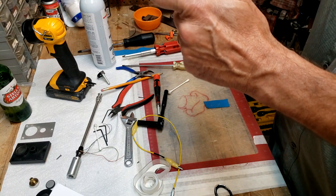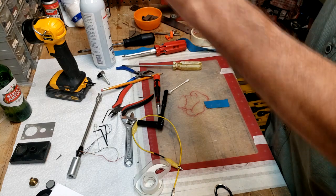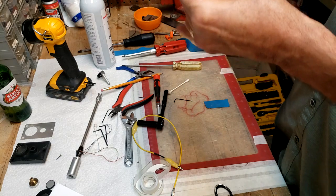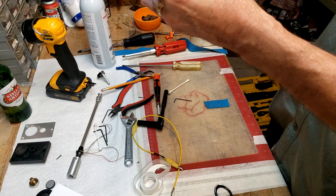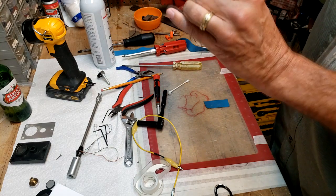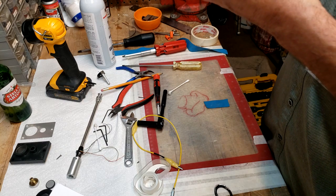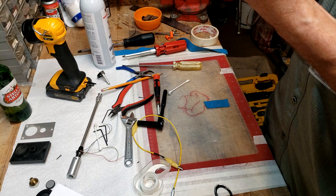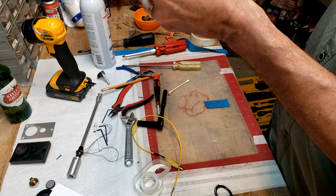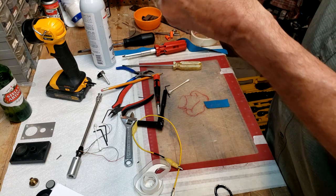So it looks like everything is working good. You can see the magnet going up to the main ring magnet there, and that's going to fix the anti-skate. There we go. And everything is nice and square and flat, I believe. Just one more adjustment here. There. That's square and flat. There, perfect. And you've got free motion. Perfect. That works.